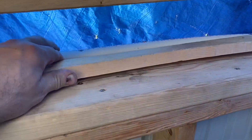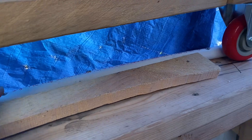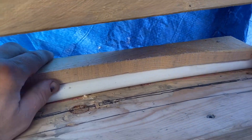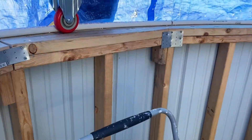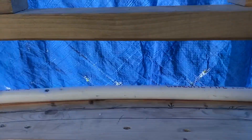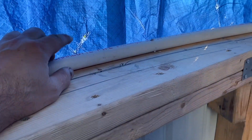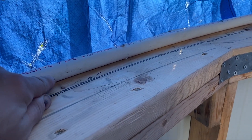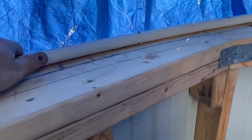The other problem I had was what to use as the guide. I started off trying to use cut wood, which is expensive, and the casters would try to ride up on the wood — it just wasn't working. It was also rough, causing abrasion of the wheel. It was taking me a long time to figure out what I could use as a track that was flexible enough to form a good circle but also strong enough. It turns out that 3/4-inch PVC pipe works — it's also cheap. Because it's curved, only the outside point touches and pushes on the wheel, and if you put enough screws in, it's pretty strong.